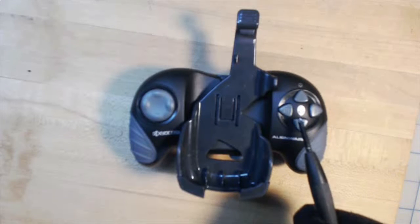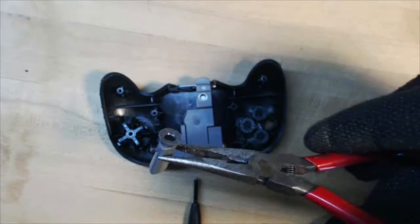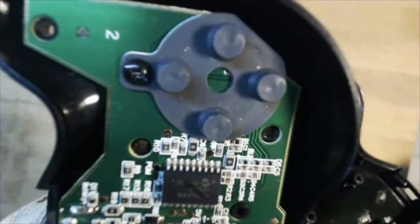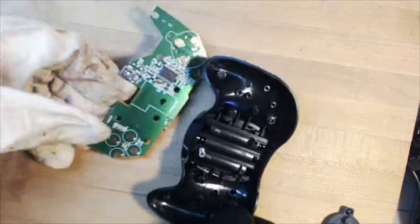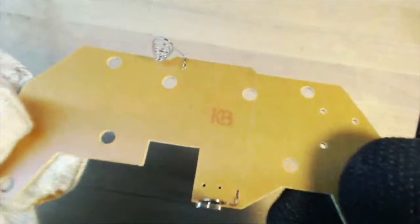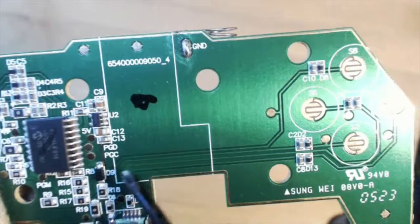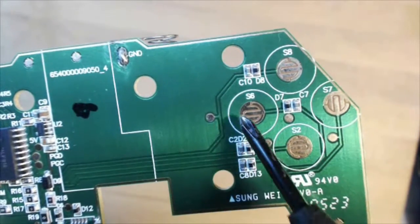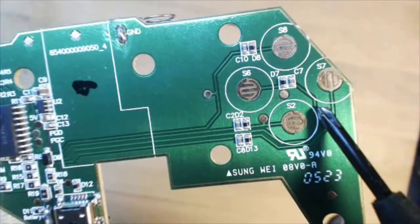Let's start with the simplest and oldest. It's got a four-button pad and a fake four-way joystick pad. The phone cradle detaches from the controller. Inside, we see that each button is a hard shell with squishy elastomer pads attached. The four-way toggle has the elastomeric pad attached to the PCB with a rocker in the shell. Under the elastomeric pads are exposed traces that get bridged by the conductive elastomeric pads to register the button press. There's a battery holder for three cells for a total of 4.5 volts. The PCB is a one-sided design with mounting holes drilled into it, and all the components and circuit traces are on one side, so it's easier to understand and should make it simpler to reuse. We can see the path of the circuit from each button pad, with some resistors and maybe capacitors on each. There's also an exposed test pad for each button, and the ground connection is well labeled.